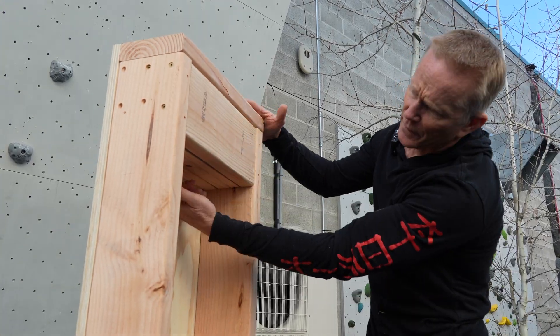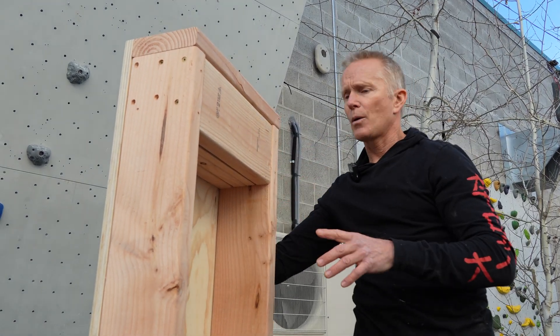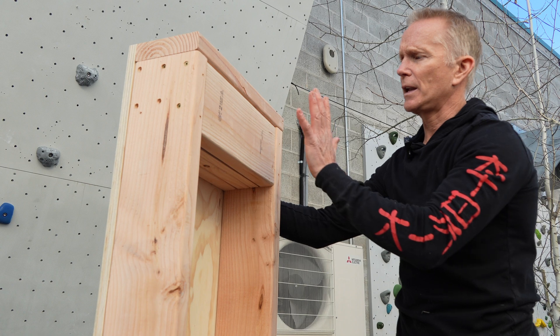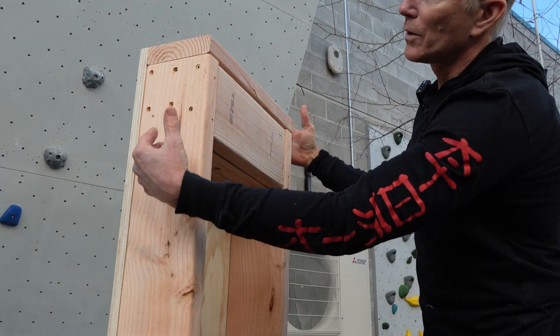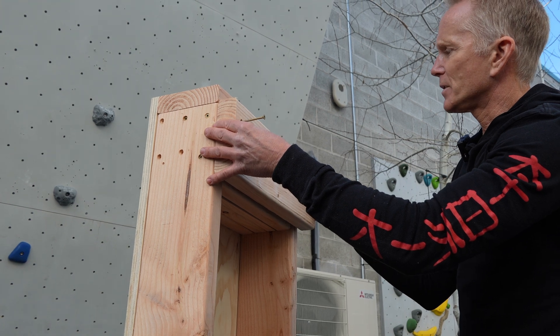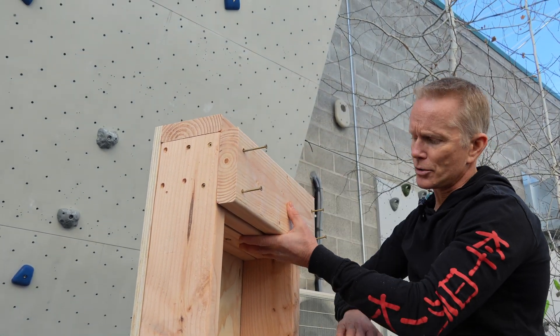We've solid blocked the entire wall through, so that when we're attaching our True Mount, it's going to go through solid material. When we tighten it down, it's not bowing the wall, and this is attached to structural. On this side of the board, we've attached all this blocking through the sides. In addition, we're going to put this plate on the back, and this is going to put the load onto the frame.